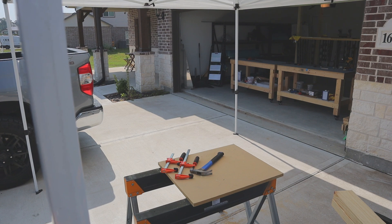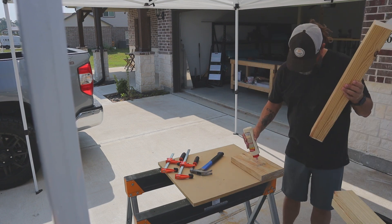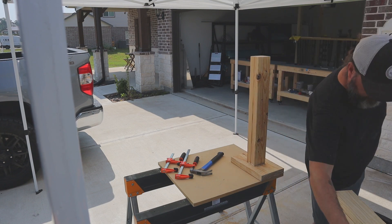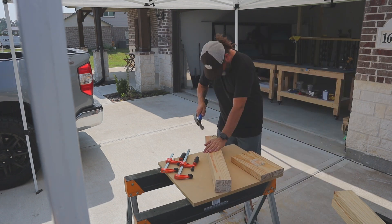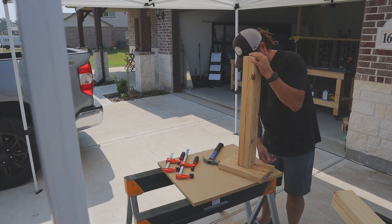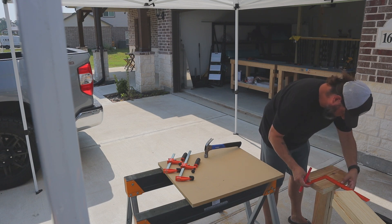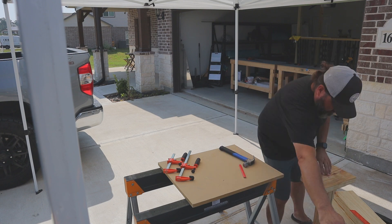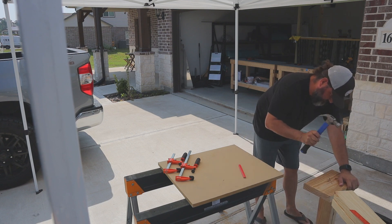It's worth the effort to do something that leaves space so you can use little wood shims. If you're not familiar, if you go into Lowe's or Home Depot you can get packets of wood shims — probably near the windows section — for like four bucks and they'll last you forever. Once I get this thing in here, even when you're hanging the skins you can just reach under there and make fine adjustments to those shims to get the height of that support exactly where you want it so everything fits together really nicely.